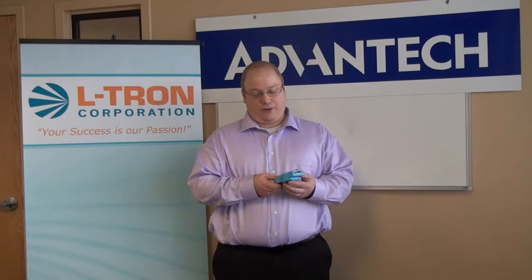What's the advantage of using the Atom 4520? It's transmission speed, it's range, and it's network capabilities. With this, there's a lot more potential with 422/485. You've got something that allows you to do what you really can't do with anything else. If you just had RS-232 and something requires 422/485, this is going to get you out of that situation. And out of all the Atom modules, this is the most economically feasible — you can get these for under $90, and they'll last you for years and years.